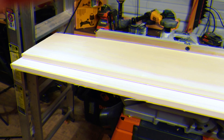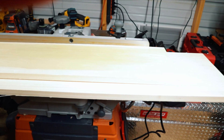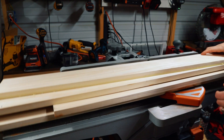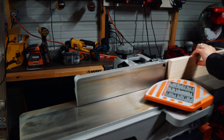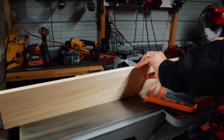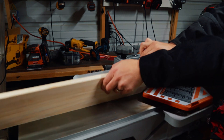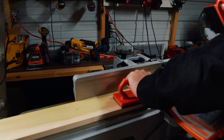The wood we're using today is poplar — definitely a little bit more expensive than pine but much better quality. You can find this at any big box store. I took my boards and cut them in half; originally they were eight inches wide but my jointer only does six and a quarter. I really wanted these edges to be smooth and on point, but if you don't have a jointer, don't worry — just find something that's milled half decent.